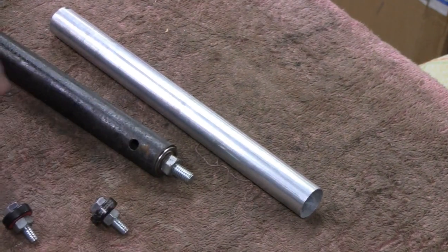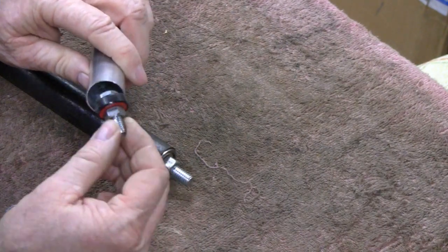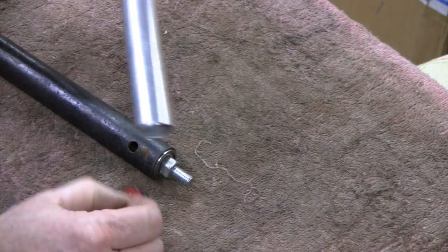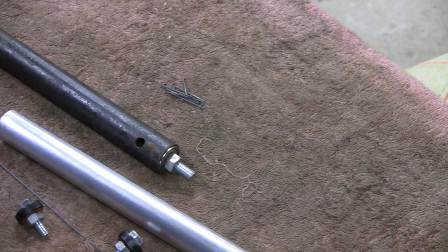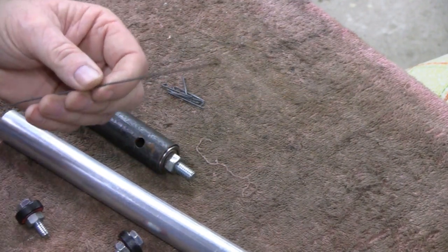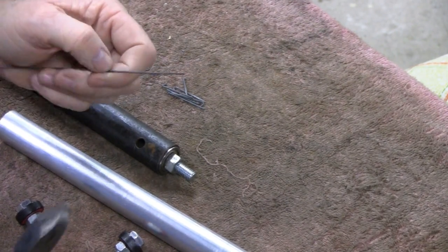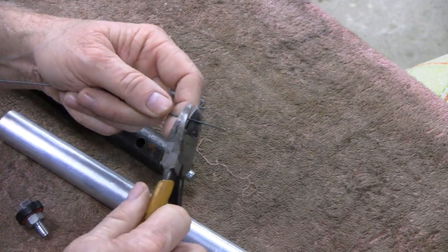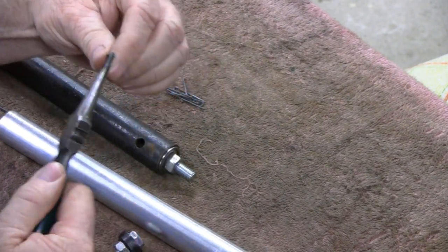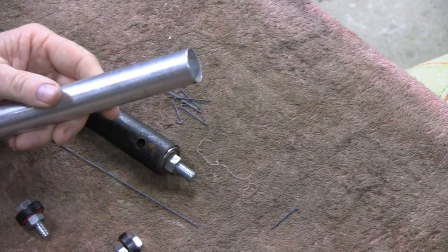These bearings don't quite fit in there — I think the outside is like an inch. So here's what I'm going to do. I got a piece of soft wire — it's for tying rebar and re-rod together, softer than bailing wire. I'm cutting about an inch pieces and just bending the end to make little J-hooks. I made six of these. I take three of them, stick them in here pretty evenly spaced, then force the bearing in. That's going to center the bearing inside the tube. It's actually holding it in there.